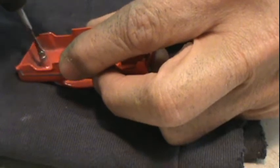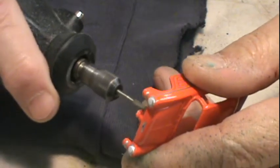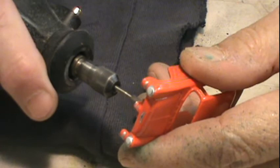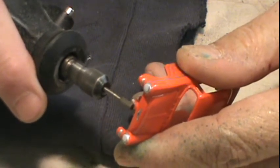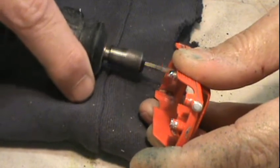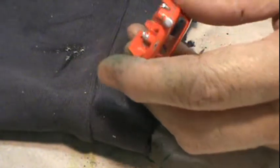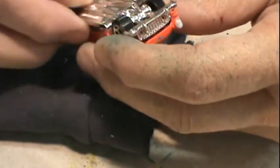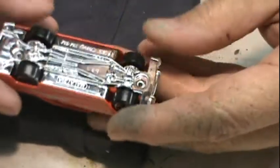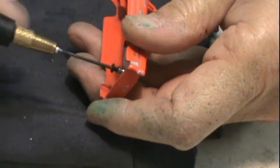We got it drilled, tapped. Now I'm cleaning up the rivet post to make it go back together a lot easier. I thought I lost this footage, but I was able to get in touch with an 8-year-old child who knew more about computers than I ever will, and they were able to save the footage. So put in our button head screws for reassembly into the stripper.